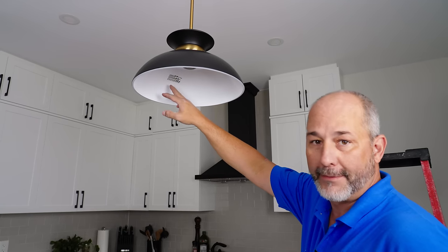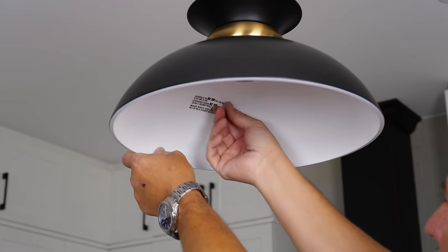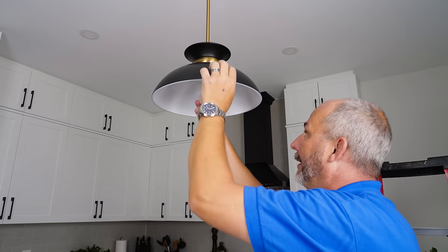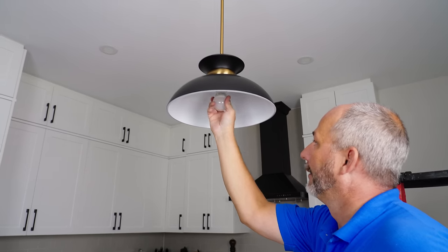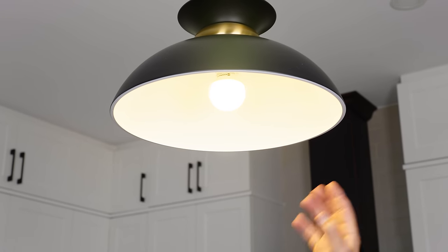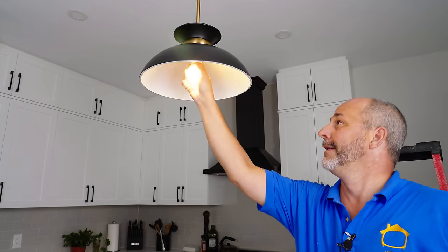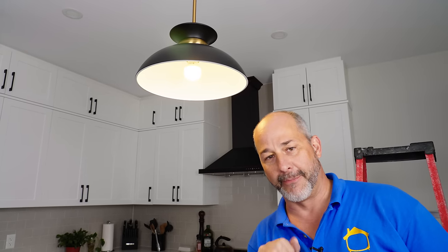Before we go any further — inside every light fixture there's always a sticker telling you what type of light bulb to use. It says maximum 100 watts. It's on an adhesive designed to remove without leaving a mark, so get rid of it. These bulbs were bought to match the same color temperature as the rest of the lights — this client likes warm light. All the pot lights and pendants will have the same color temperature. It's very important to keep that in mind.